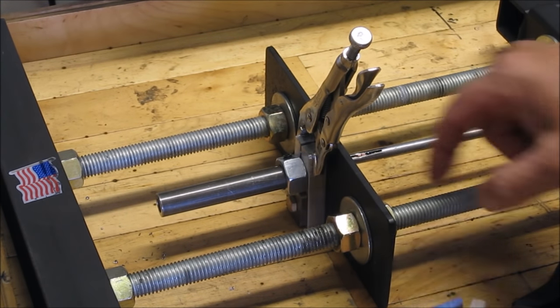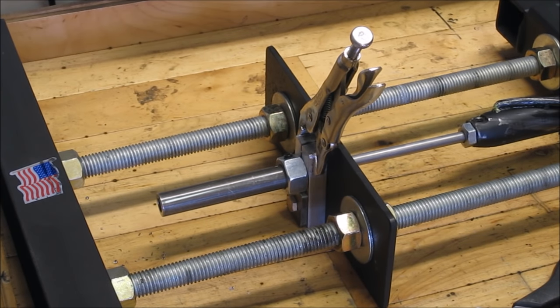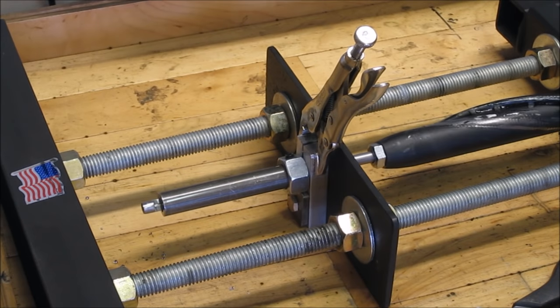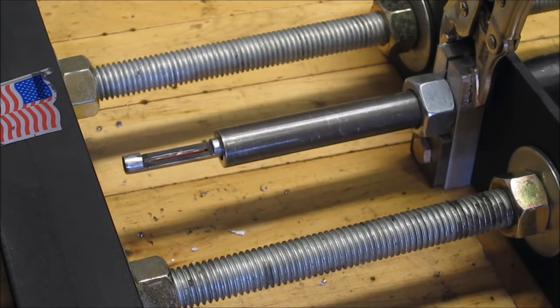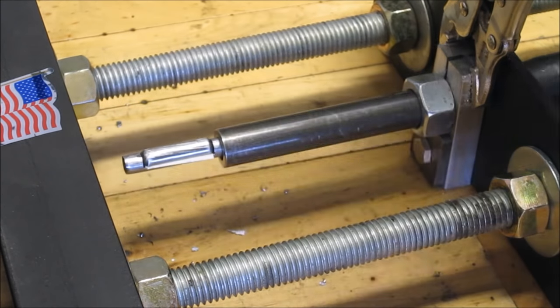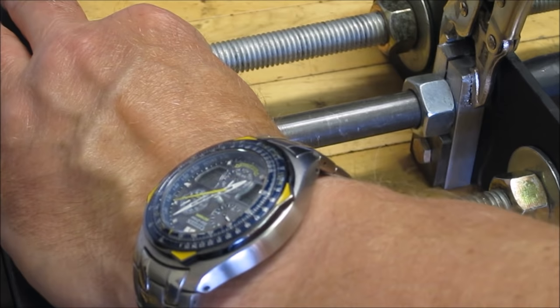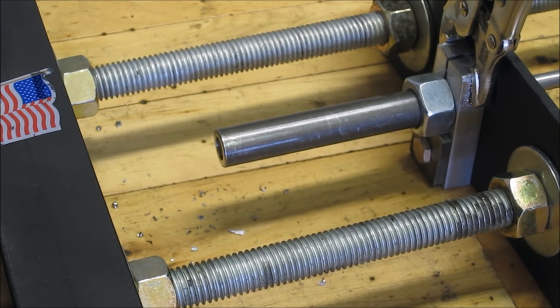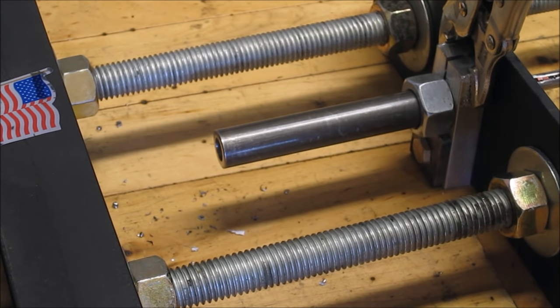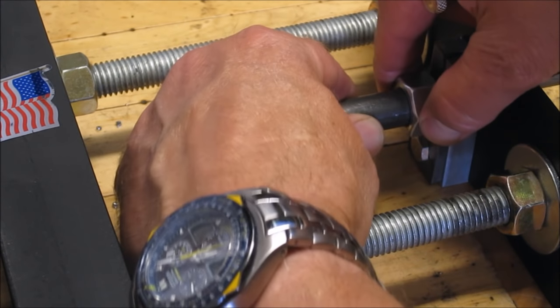I can tell that made a cut because I could feel the resistance on the drill. After the first pass with a single layer of cigarette paper, I can definitely see six nice rifling grooves in the barrel. This is a double wrap of paper, so it's about two thousandths deeper. I've seen little shards of metal coming off from inside the barrel, so I know it's cutting something — and on to the next index mark.